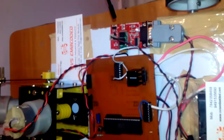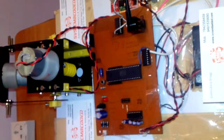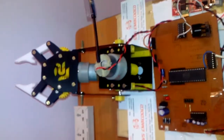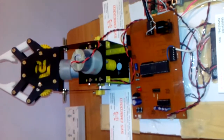We are using an HC-05 Bluetooth module working at 9600 baud rate. It is a peer-to-peer network with a maximum range of 5 meters. One L293D is used with Motor 1 and Motor 2 for moving the robot, and another L293D is used for the up and down purpose, with two motors connected to it.